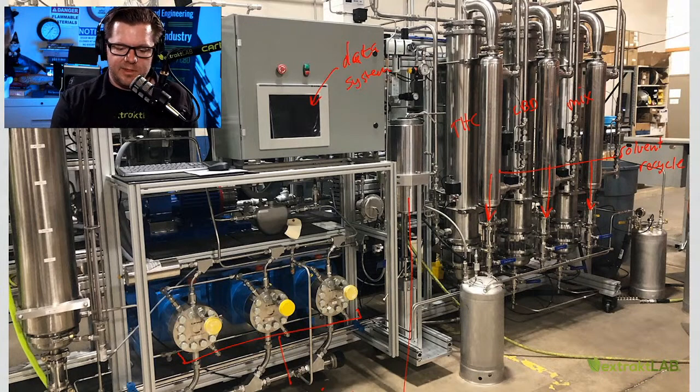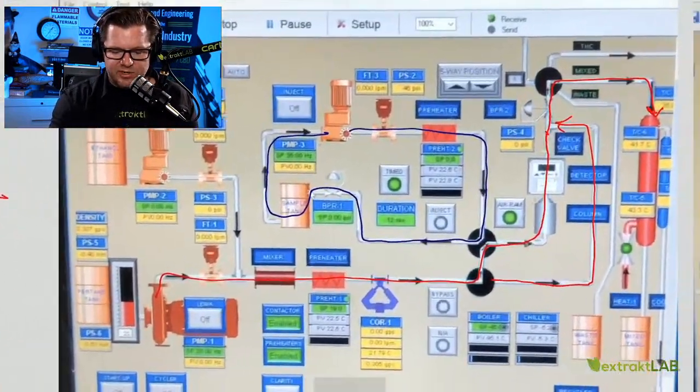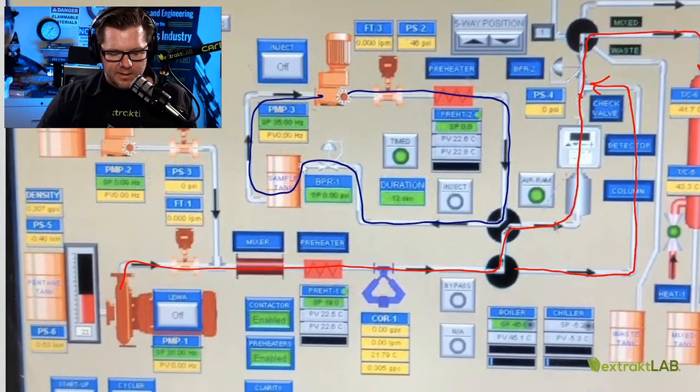And it does that with three separate falling film evaporators, essentially. So the fluid comes through here, and then it comes in here. And the volatile component gets evaporated and comes out here. And then it gets condensed here. And then this goes back into a solvent recycle right here. So that's how the system works. It's pretty neat. Just to give you a picture of that in a more pictorial way,